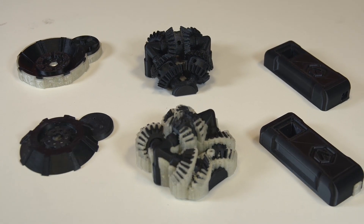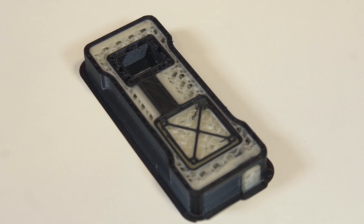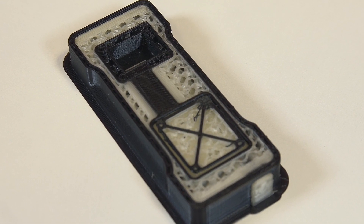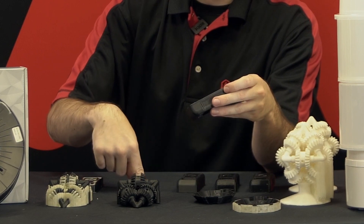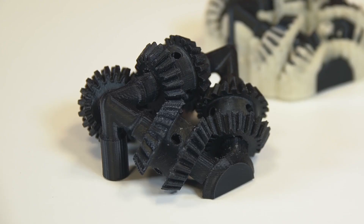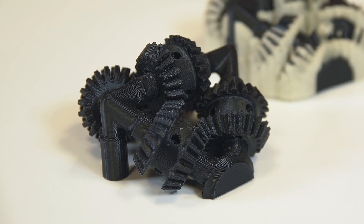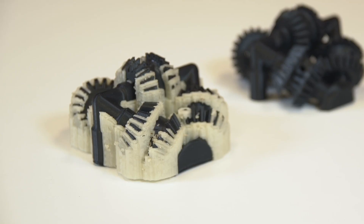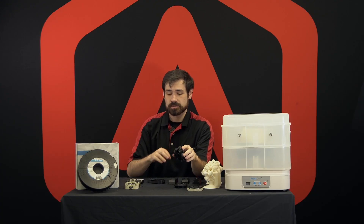For something like ABS or ASA, on these test prints here, there was a little bit of difficulty with layer bonding for the smaller details, and especially on parts that are being printed essentially as islands — parts that are putting the layers down directly on top of the support material without having a direct link to the bed itself. For the brain gear prints here, the frame across this is going to have better overall success rate because it has anchors that go all the way to the platform. The gears themselves are floating, and in these cases, the teeth at the bottom, which are going to be printed directly on support structure and nothing else, are going to be the most sensitive points in the rest of this print.